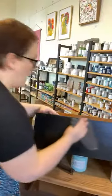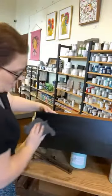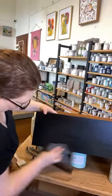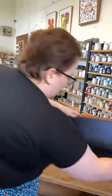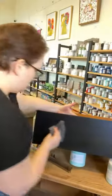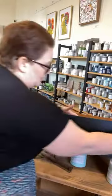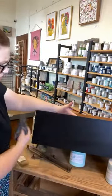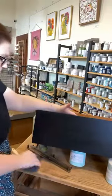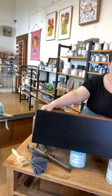All right. So there's four drawers. We're going to leave the other big one just because it needs a touch-up paint, which I only noticed right before we came live. If I'd noticed it like half an hour ago, I could have done it, but I didn't. And speaking on that as well, I do like to at least give my paint overnight to fully dry before I go in and seal it, regardless of what sealer I'm using. You can seal straight away if you want as soon as it's dry, but sometimes it's nice just to give the paint a second, just to make sure it's fully dry as well.